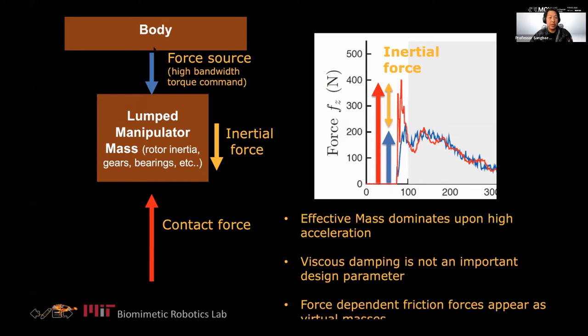With Phantom, you can display force sensation without any force sensor feedback. We thought that's probably the best way to generate ground-reaction force at high bandwidth. High bandwidth is very critical in most manipulation and locomotion. If you think about a robot body as a floating body, you always have to think about the inertia through the linkage system — your leg. Legs are not that heavy, but the motor's reflected inertia actually dominates.